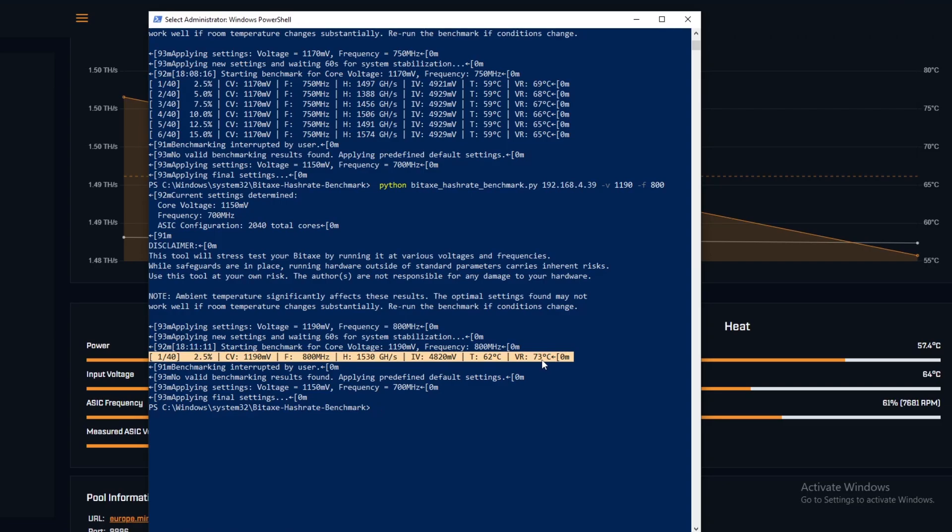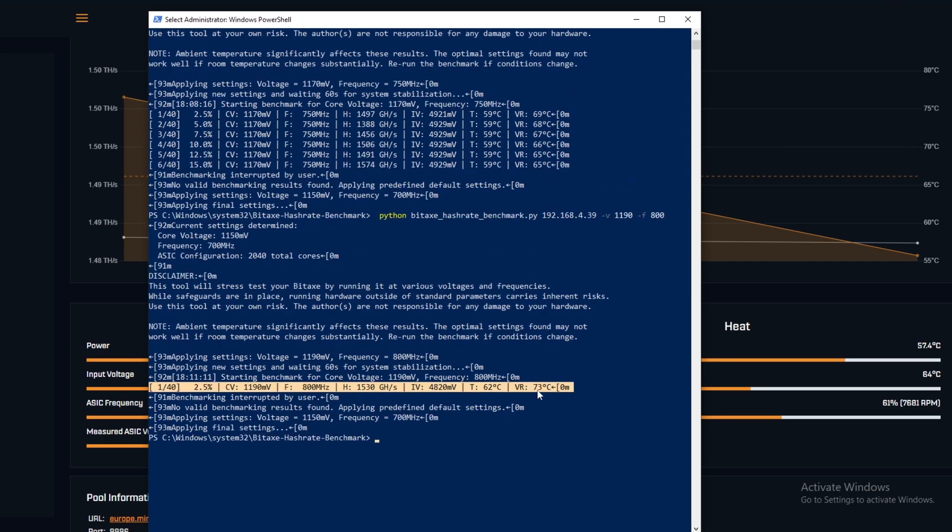I'm going to upload this video and let you know what you think about the double fan setup. We're not going to run it for now - we'll put the single fan back on. It does show we can get way more terahash out of it. If we could get it stable at 1800 or even 1900, maybe two terahash, I think we can do it if we have an extra fan on the back, since heat only reached about 73 degrees - far from the 94-degree limit I've set.